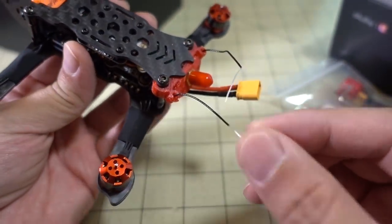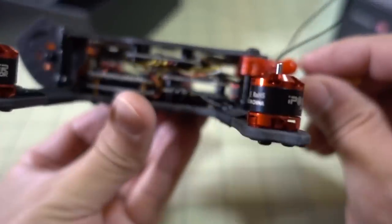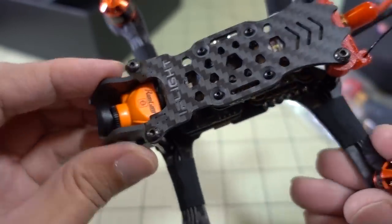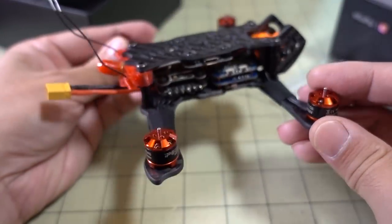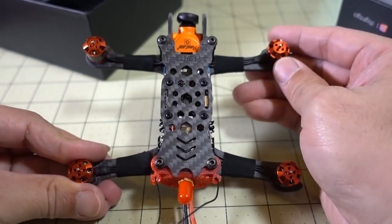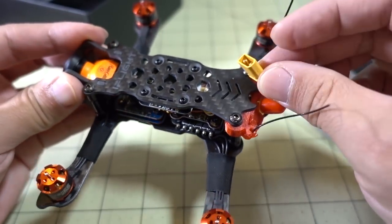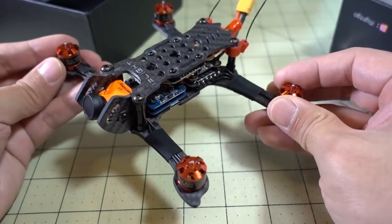You've got the XM Plus receiver. You'll cut that fiber tube in half and stick them on. And there's your SMA adapter — pretty clean build for ready-to-fly. This also comes with the buzzer, also mounted upside down. The frame looks a little different from mine, so mine might have been an earlier generation. These are 1106 6000KV motors, so imagine 3S batteries only — my build was a 4S build. I'll do a flight review on this one pretty soon.